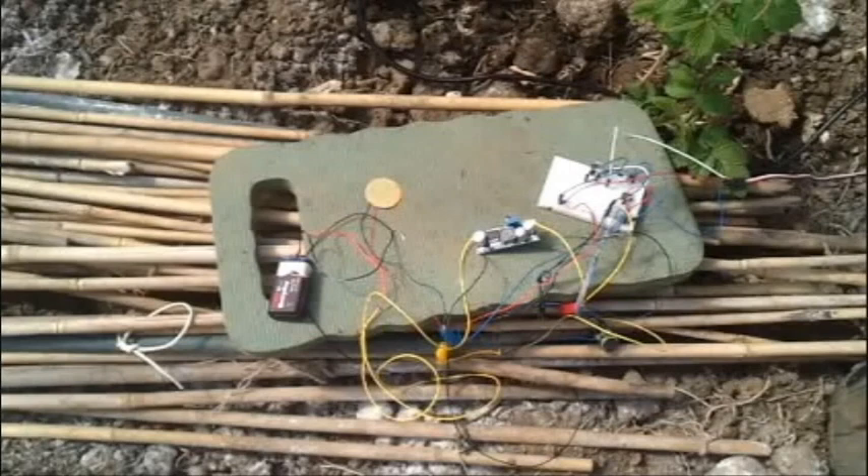The system tells you what it's doing through the piezo crystal and a sound interface. It's quite simple. When it's in the monitoring phase, it bleeps one number between 1 and 9 to tell you what moisture level you set using the potentiometer, and it bleeps another number between 1 and 9 to tell you what moisture level it's just read from the soil. And if those values compared suggest the tap should be turned on, then it makes another noise to tell you that it's about to do that.